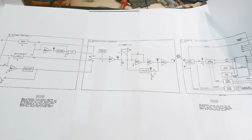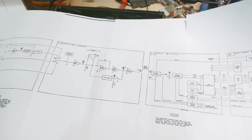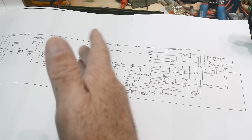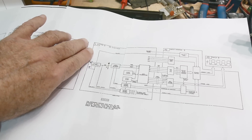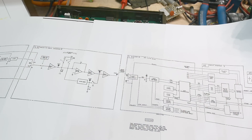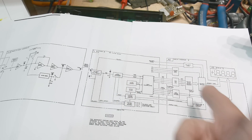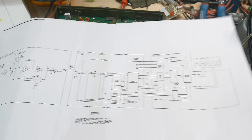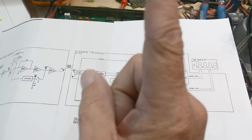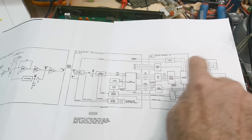When troubleshooting something it's nice to know what it's supposed to be doing. This thing is difficult to troubleshoot because it's all intermixed. When you put that jumper on, you're breaking it right here and letting this section operate on its own. The digital system is basically a counter and a latch - it counts and puts the number on the display. It counts between two pulses: one pulse starts the count, another stops it, and the distance between those pulses gives you the right value.